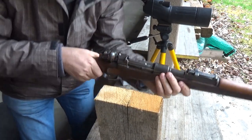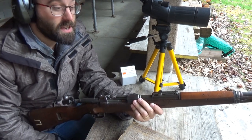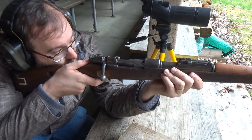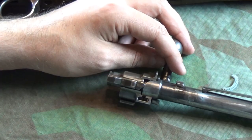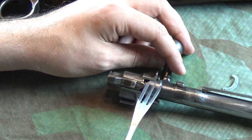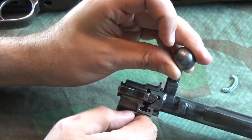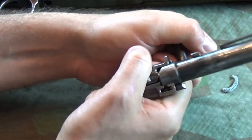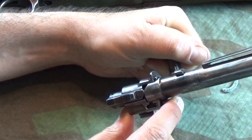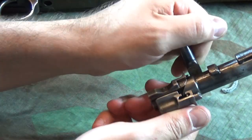Remember that a lot — if not the majority — of German 8mm Mauser ammunition during the war was steel-cased. Another interesting point of wear: the cocking piece at the back has become quite rounded, and the corresponding camming surface has also become quite rounded, to the point where if I press in the plunger it will just automatically snap closed. There's now no mechanical blockage between those two surfaces at all. This actually helps with the smoothness of operation, so in rapid-fire testing this will be very much in the rifle's favor.